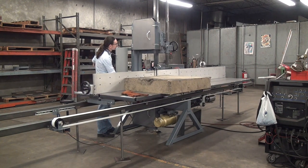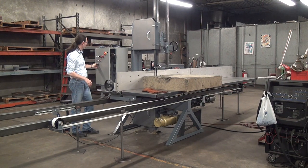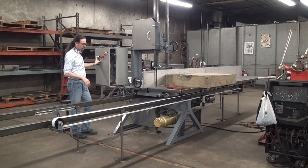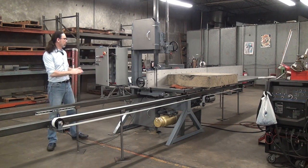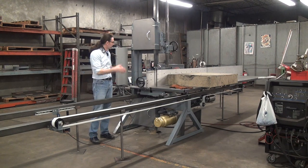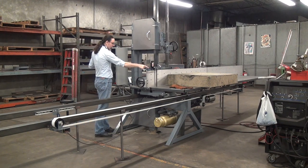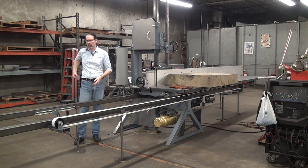That's running at about one inch per second — just that easy. I'll let it go to the end and auto-stop, and that's what it does. So this is the Model 204. The heavy version includes the rail-mounted table, giving us the flexibility to make the table for a heavy workpiece, a wide workpiece, or a very long and skinny workpiece. Pneumatic tensioning, basic controls, roller blade guides, and a five horsepower blade drive motor with a brake — when I hit stop, the blade stops pretty much immediately. If you have any questions, please feel free to call or email us at Forrest Manufacturing. Thank you.